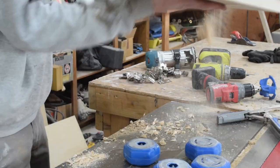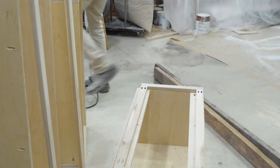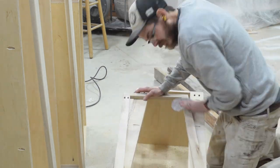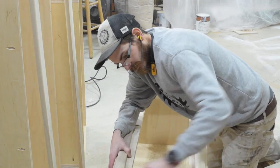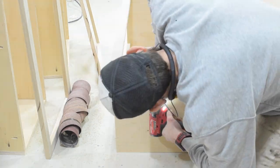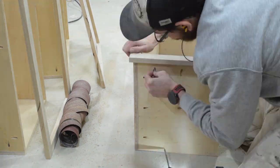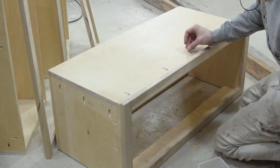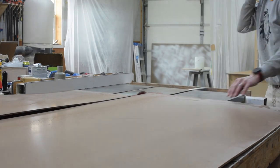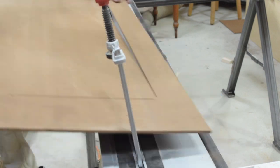Since this is a face frame cabinet project, with all my face frames I like to hit them with that 1/16th roundover bit and finish with a little bit of sandpaper before assembling the cabinet boxes to the face frames. The quickest and easiest way for me to do this is to use pocket screws on all the sides to attach the face frame to the box. The reason I do that is the face frames are on there, but if I need to adjust anything I can take them off and put them back on — it's a very good system that I'm happy with.